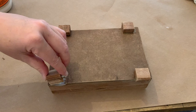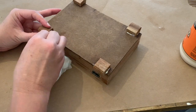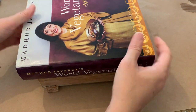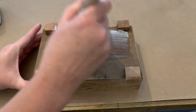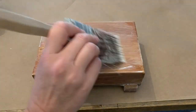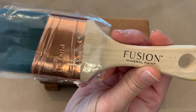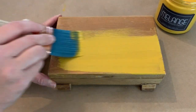Three of the little feet were loose, so I scraped them clean, got out my Gorilla Glue, added some to the feet as well as the box, wiped up the excess, and set a book on top while it dried. After about two hours, I flipped it over, put the book on top again, and let that set up for the rest of the day. Then I got out some primer — this is Dixie Belle Boss Primer in Clear. I would typically use a white primer, but I had this in a smaller size, making it easier to bring inside for this indoor project. After the primer dried, I got out a new color for me: this is Bohemian Gold by Melange Paints, a deep mustardy gold, and I also took this opportunity to try out this little brush by Fusion, whose thinner bristle silhouette I thought would work really well for this project.